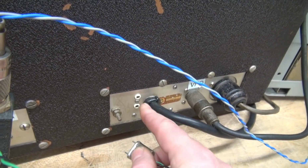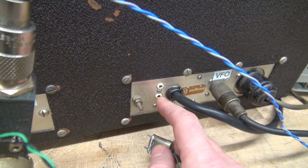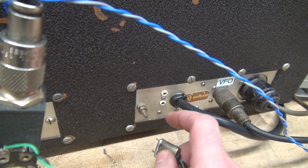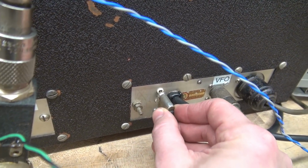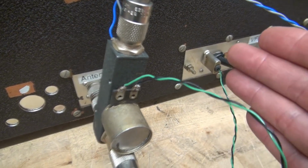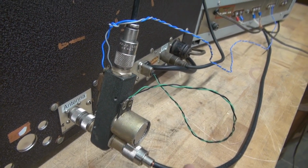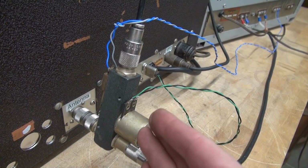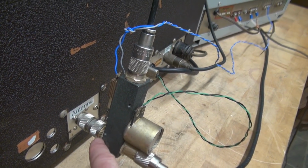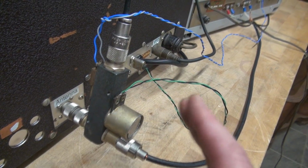So you got this little crystal socket. Okay? Actually, when you flip the plate or you key your microphone, if you have push to talk, you'll get 120 volts across those two little pins. This guy plugs in that gives you coil power. So when you key the transmitter, this antenna that is normally closed to the receiver flips. Okay, so now this opens, this closes, so now your transmitter is going to the antenna. The receiver connection is opened.